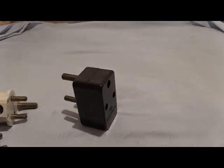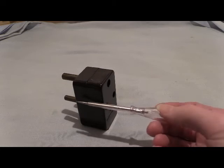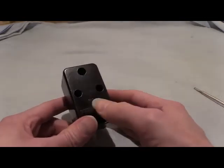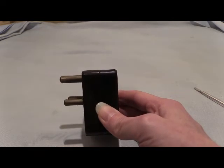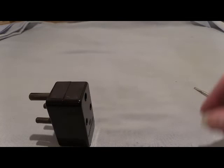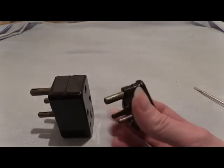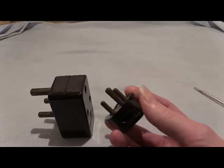Now for one of the advantages that MK built into this over most other adapters: the 5 amp outlet is fused. The 15 amp one is straight through — unrestricted — because the socket it's going into will already be 15 amp fused at the consumer unit. If you've got a 15 amp plug going into a 15 amp socket, you don't need additional fusing, and these plugs are not fused themselves. But if you've got a 15 amp supply and you put a 5 amp plug in, that poses all sorts of problems, as it did with other brands of adapter where a 5 amp plug could be used unrestricted in a 15 amp socket.